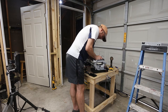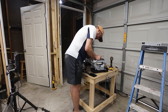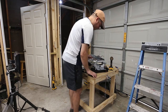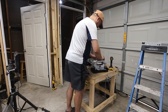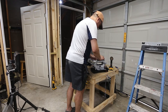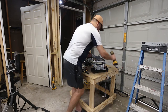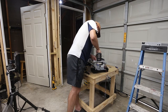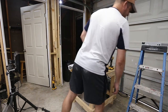Insert these ribbon cables very gently, just kind of work them in, and then we'll do the two little connectors with their wires, the 2-pin and then the 3-pin, and again these only go in one spot, and then we'll go ahead and button this printer back up. Put the screw that came out back in, and it's just one less thing that has to be messed with. All right, so that's in, and this can go in my little box of maybes.